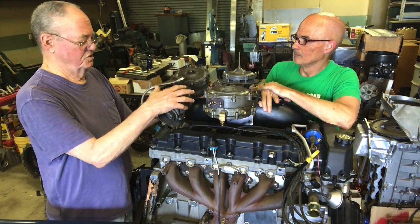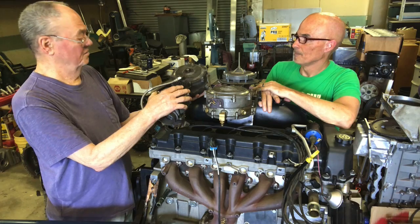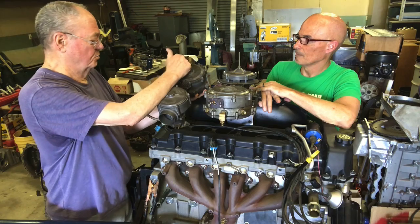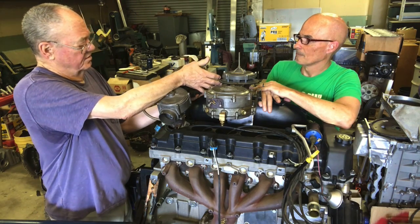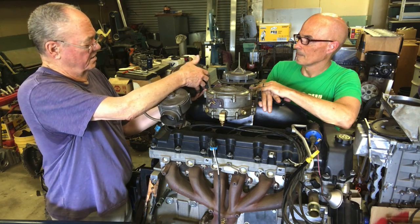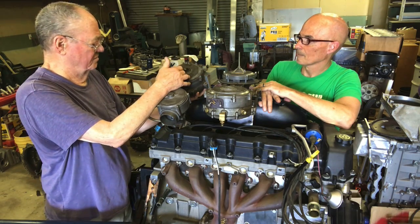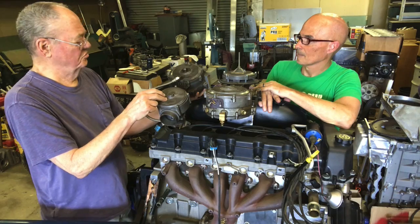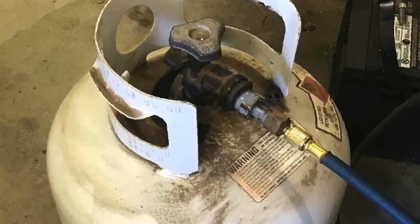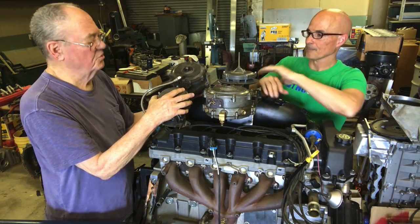The carburetor in this case is called a mixer. It's going to mix the incoming air with the gas instead of a liquid. The gas is provided by this converter. The gas comes as a liquid into the bottom of the converter, where the pressure is reduced. That's communicated to the mixer, and when the mixer demands gas, it provides it. In the propane tank from the store for our barbecue, it's stored as a liquid under pressure.